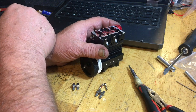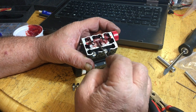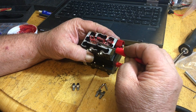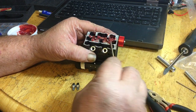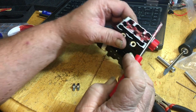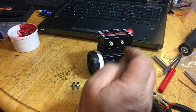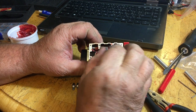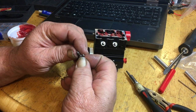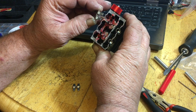Now, after you get it running, if everything seems cool and you have no problems with the rocker arms loosening up, then just keep rolling with it. But, you know, we have to tear the heads off these things to do maintenance. Now, I came up with this crazy idea years and years ago, and I think everybody kind of followed my lead on it, was to run this tube here up into the valve cover with a drain hole back here. However, I thought about it after a while and I'm like, was it necessary or not? I mean, we don't know. It can be good, it can be bad. And they did put a lot of engineering into this engine. And to say what's right, what's wrong, I don't know.